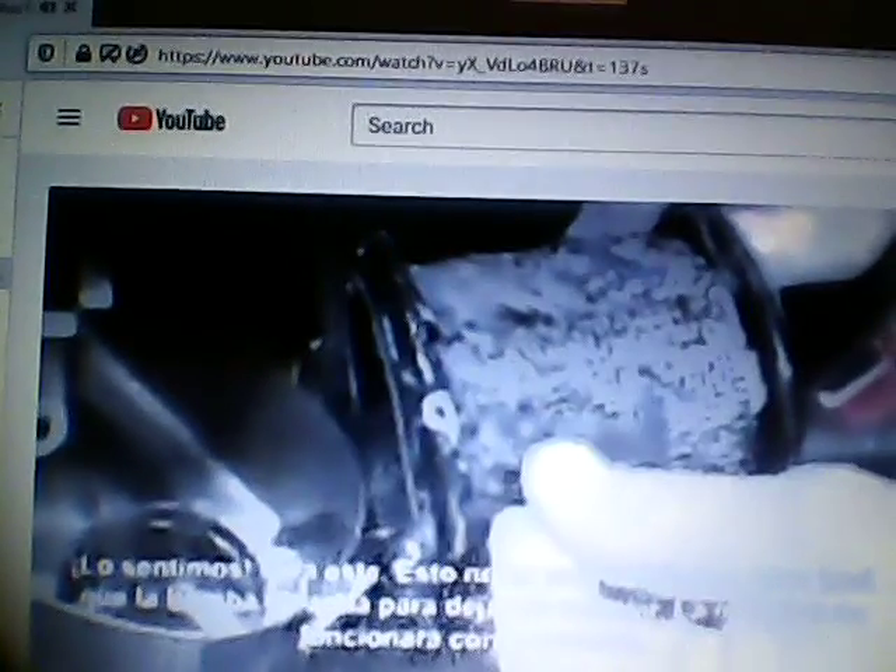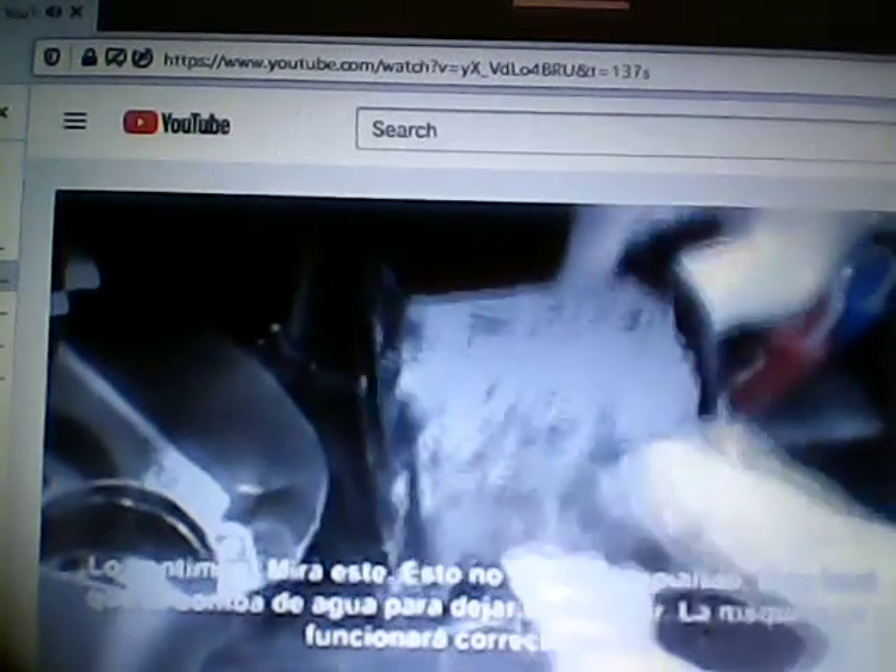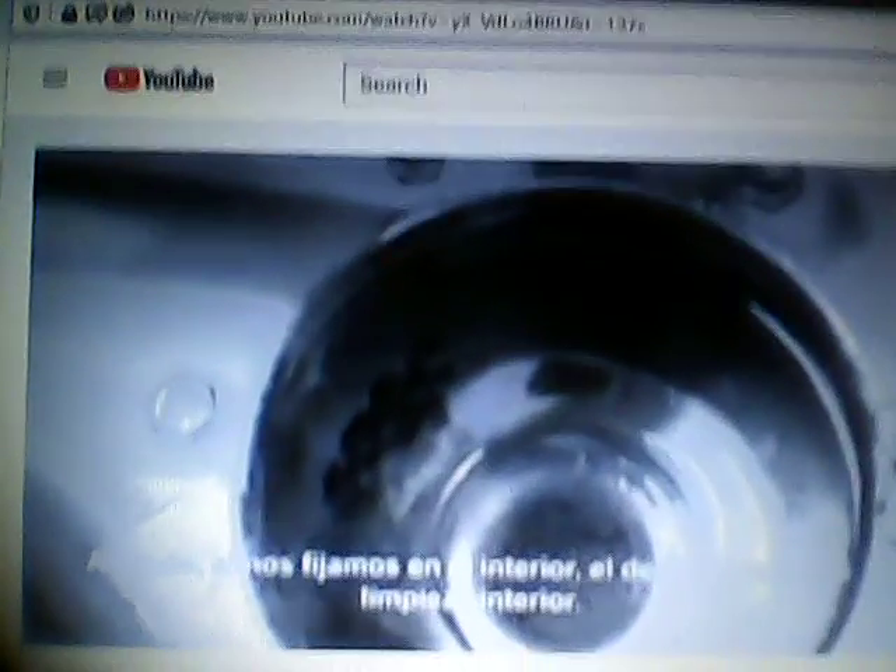This strainer is not being cleaned. This will cause the pump to starve for water, and you won't get the proper cleaning action out of the machine. Also inside here, you'll see there's an area that's got to be kept clean as well. Take it to the other machine, spray it off, and then come back.